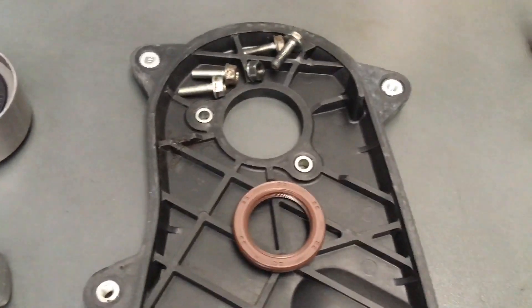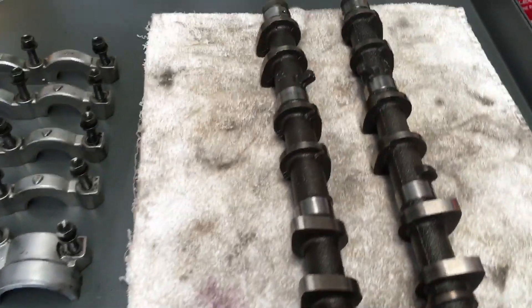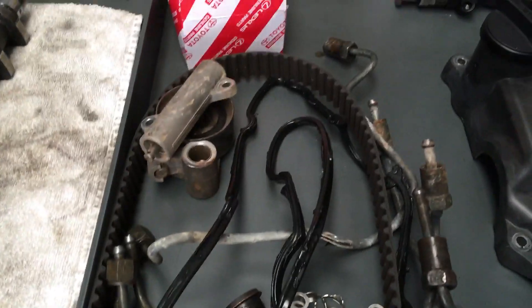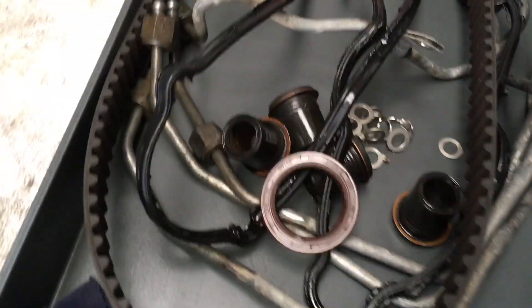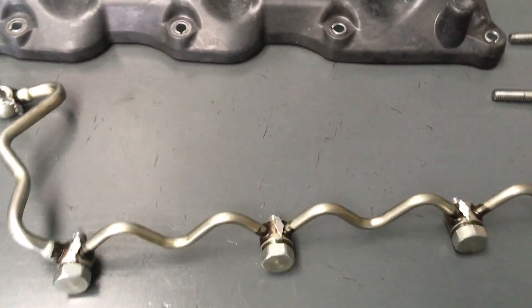This backing plate was covered in oil and grease, leaking everywhere on both sides. Clean up all the bolts. Got a new cam seal ready to go in, still got to sort this out, just waiting on lifters. Here's all the old parts — there's a whole lip of silicon on that gasket, what a mess. That's been a lot of time.